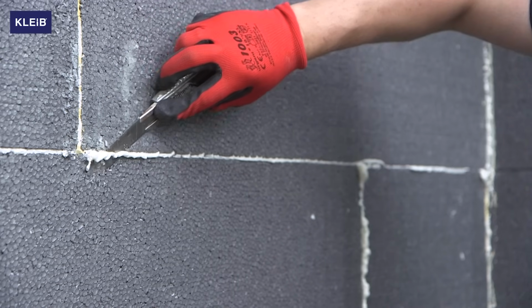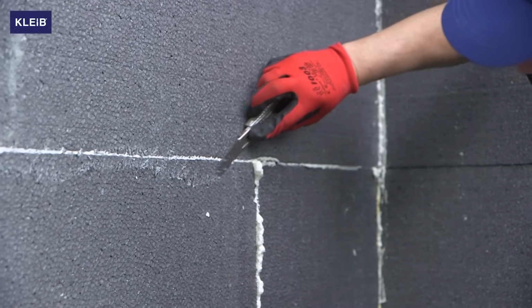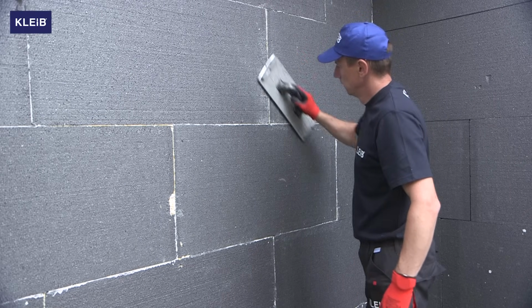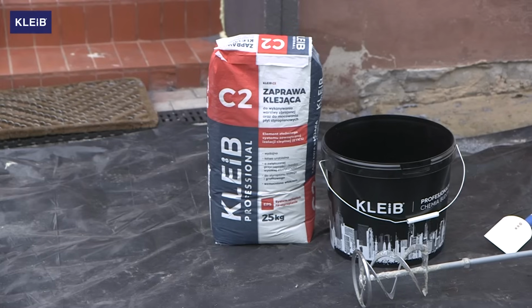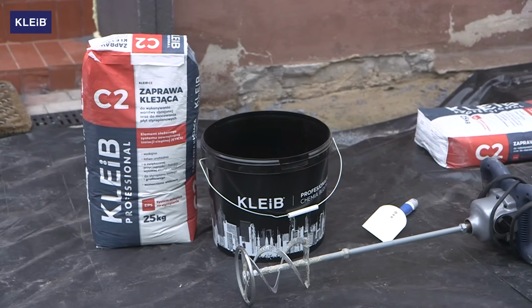After drying, the polyurethane adhesive that goes beyond the frames of polystyrene boards is cut with a knife. Once it's done, use the polystyrene grater to level the surface of the boards once again. The next stage will be fusing the mesh in the corners of the insulated window.